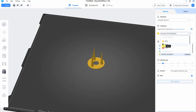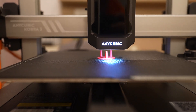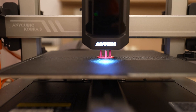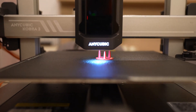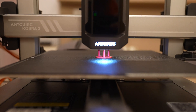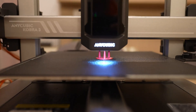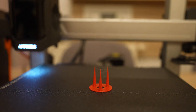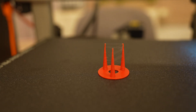I'm doing a short stringing test which I like to do with PETG filaments. Usually it starts good, but later when the tower diameter gets smaller we see some stringing. The question is when. I also need to check different temperature settings since it wanted to print this PETG at 210 degrees Celsius. Printing is finished. The stringing is very minimal.